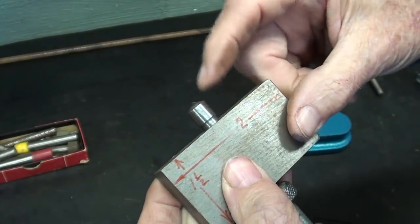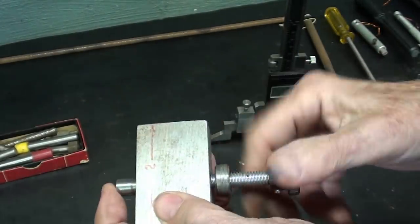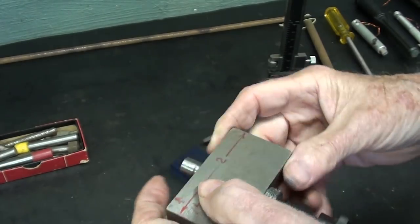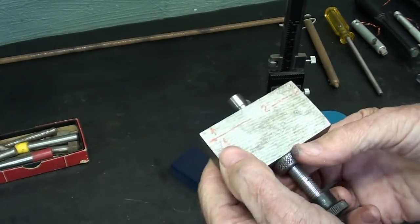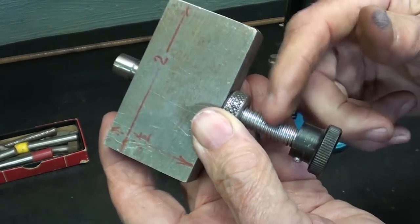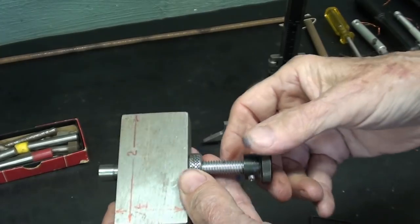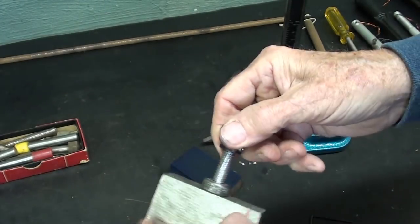There's a shoulder on my nib here, which I'll talk about in a minute, but notice that I have a little lock nut that's knurled right here, so that we would take a pass, loosen this, and feed it in just a little bit. And that's why I want to go from 3/8-16 to 3/8-24. I already said that, but let's take a look at how this is made.